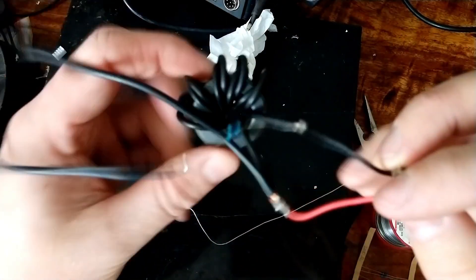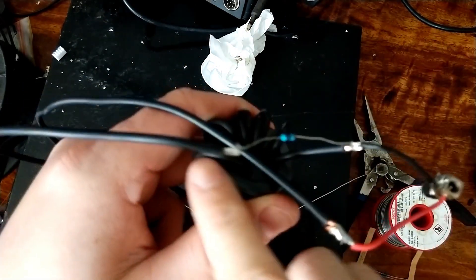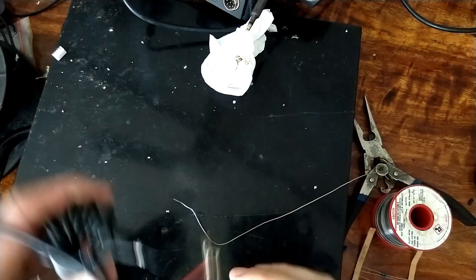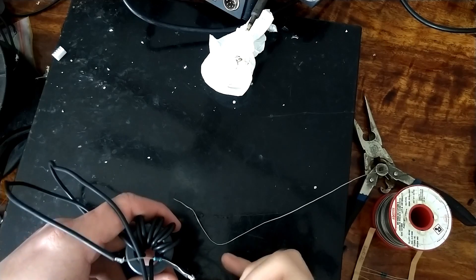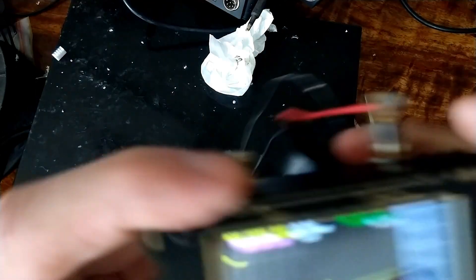Just to check - from the shield, through the load, to the other side of the transformer, through the transformer to the active, through the transformer again to the shield. We'll reconnect that and see what this transformer can do.